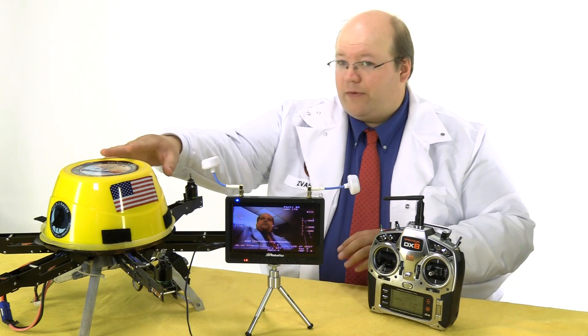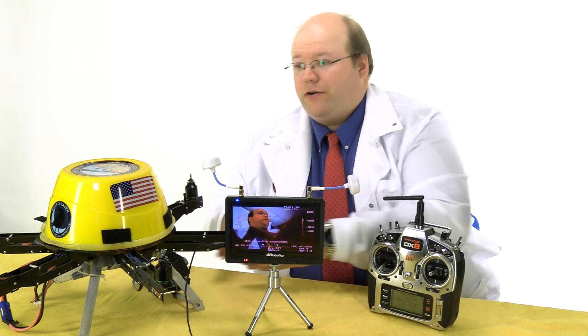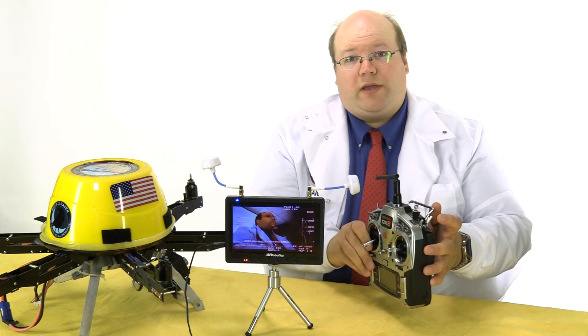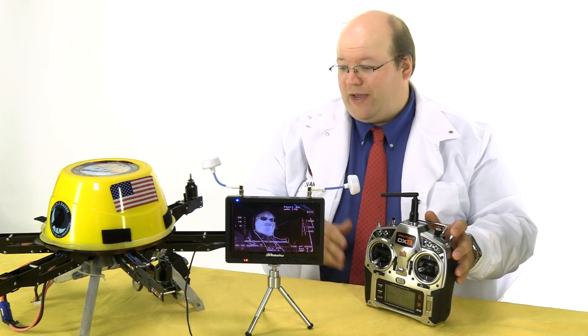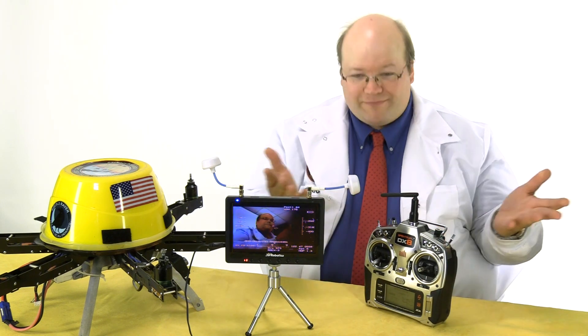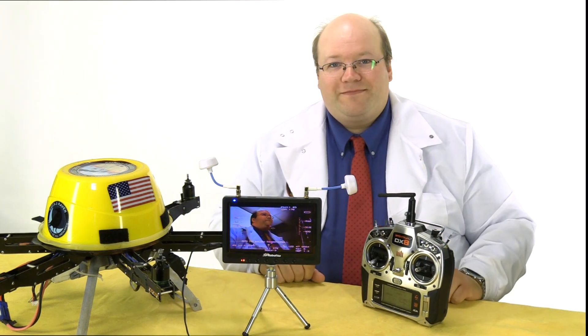So this is the setup. We have Raven with the FLIR DUO mounted on the front, hooked up on the inside and transferring to the screen. Since we use the PWM, we can control whether we're seeing visible light or thermal. Thermal. Visible light. Good to go — simple. That was how to integrate the FLIR DUO into your UAS. Click subscribe to watch our next video where we go into more detail on this item. Hope you enjoy watching — see you next time and fly safe.